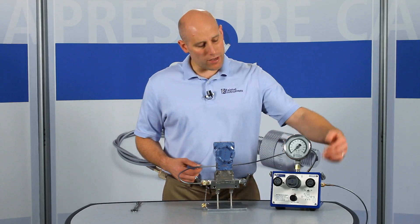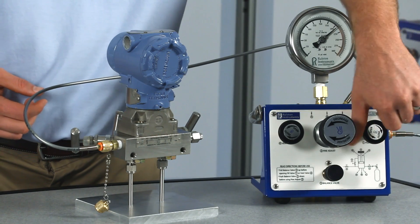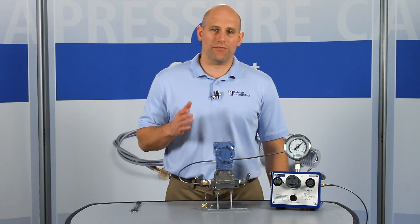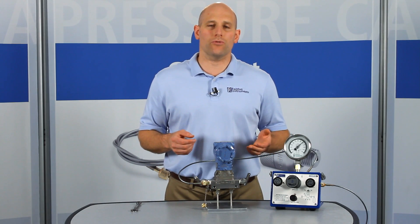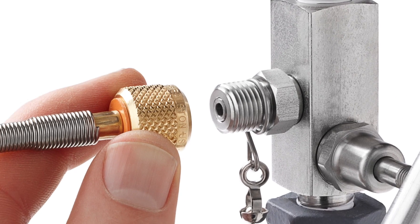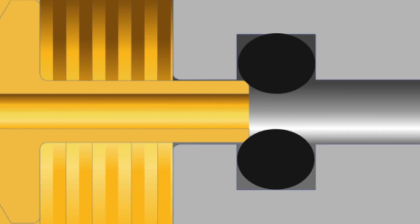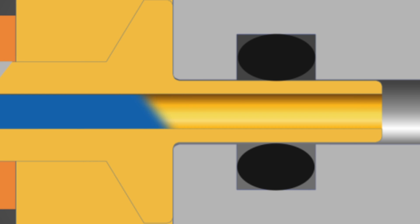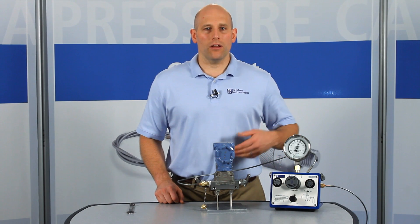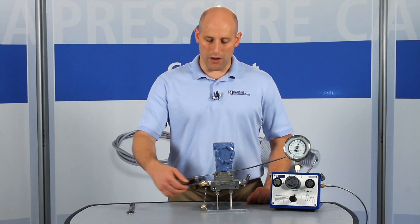Let's apply about 2,000 psi or 140 bar pressure. This adapter provides a secure connection up to 5,000 psi or 345 bar. The Ralston quick test system makes a quick leak-free connection thanks to the integrated o-ring pressure seals, and unlike some designs these fittings won't weep. When you're done, if you forget to vent the pressure off with the valve, the Ralston quick test connection will safely self-vent instead of blowing off.